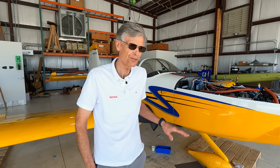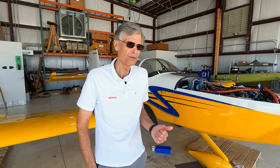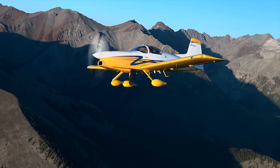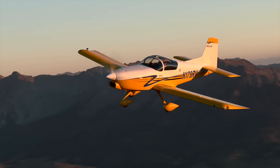To summarize: with this setup we have very efficient cooling, a good CG situation, we are lighter than the stock RV-9 with a 160 Lycoming, we're considerably faster, more efficient, and we have better takeoff and climb performance. You see a lot of what I'd call speed mods where you're hoping to get two or three knots. At some altitudes we're as much as 40 knots faster than the 160-horsepower Lycoming-powered RV-9 — I mean, that's just huge.